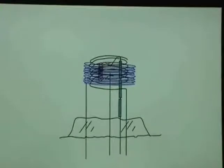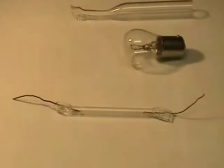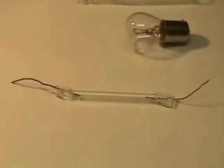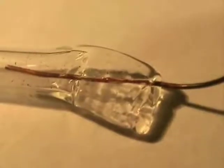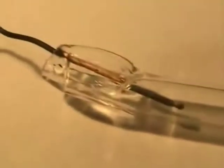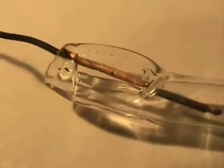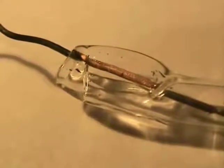Here's a small test I did with a small Pyrex tube — copper wire sealed into the right-hand side and iron wire previously electroplated with copper in the left-hand side. For the copper wire there are some bubbles forming in the seal and it hasn't wetted the wire sufficiently. Going over to the iron wire side, I have not got the black oxide I would get with iron normally, and in that seal it seems quite uniform in color with no spaces around the wire.